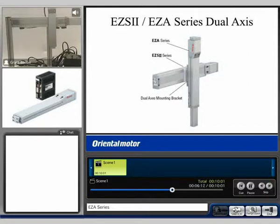Now I'd like to demonstrate what is called a push motion — a motion where we can actually limit the amount of force exerted by the cylinder. The first motion will be at full force, and the second motion will be at the 10% mark. Once it reaches that 10% mark, it will output a signal to tell the master controller to stop motion and then return to home.